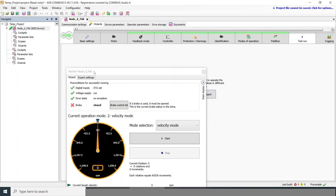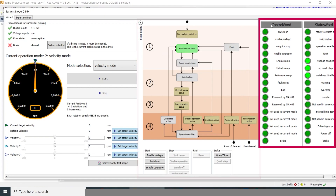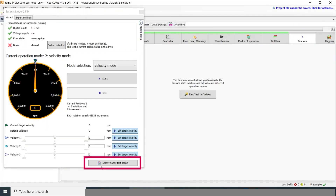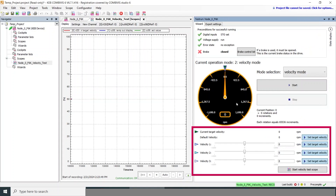And that's all there is to the setup. Now we can go into the test run wizard and spin the motor. With this, you can see the state machine of the drive that's affected by the control words, and you can see the status word coming back. You can enter a number of different speed setpoints and start and stop the motor. The scope allows you to trace up to 16 parameters within the drive so you can easily see what's going on during operation. At any time, if you drag and drop any of these windows, you can customize your viewing screen. We'll enter a couple of different speed values and you can see how they're reflected in the scope.